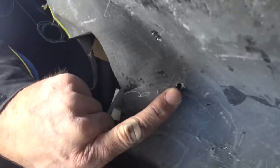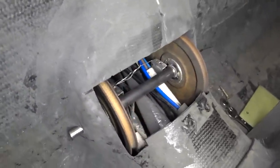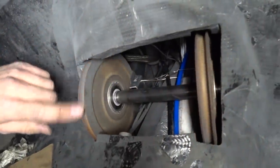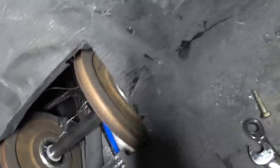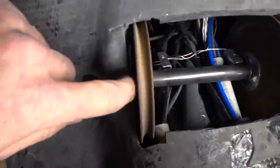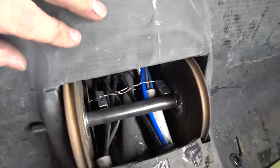There you can see it come out the other side, and that's when I did all the work to step it up. I've got the half inch hole all the way through now, and just mocked the pulleys into place. I've had to clear out around the top edge and also the bottom edge of the pulleys because the original cut just wasn't allowing enough room. That's just mocked into place here, and I've got my little spacer in the middle — which is a three quarter inch tube with a half inch ID — so that adds extra support so the rod won't flex.